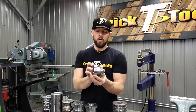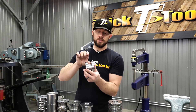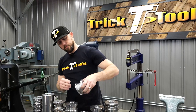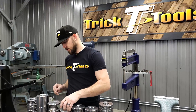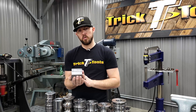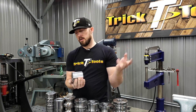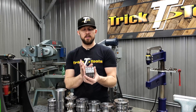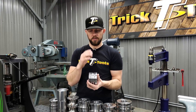This is a one inch by two inch roller for doing one inch by two inch material the hard way — the material sits two inches tall and one inch wide, and you can roll it the hard way, which is pretty cool. Here we have our regular inch and a half square tubing die, a one inch square tubing die, and inch and three quarter round. These flat dies are for doing flat stock material — three inches wide, so you can do up to three inch wide flat stock. This last one is for doing flat stock the hard way, with a number of different grooves so you can roll flat stock the hard way.